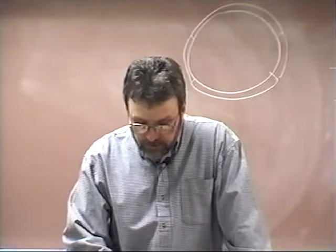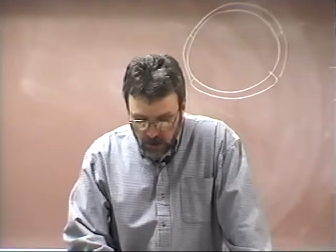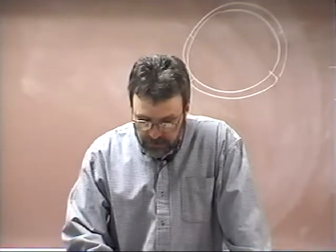It says controlling the amount of undercut is important because, like the electrode, the base metal has a high tensile strength. 8010 has a high tensile strength. The undercut at the fusion line raises the stress. That's what I want you to remember. The undercut at the fusion line raises the stress. Why? Because undercut at the fusion line is a stress riser. If the preheating temperature is allowed to drop, the stress in the areas of the undercut increases. The weld is likely to crack because it fails to withstand the applied load. All right. There could be one or more questions coming from that section there. So read it, understand it.